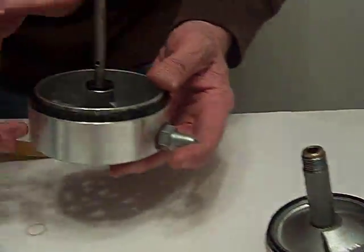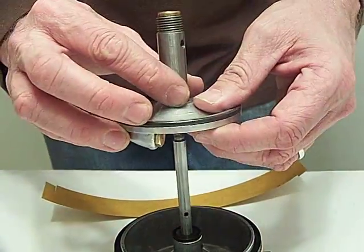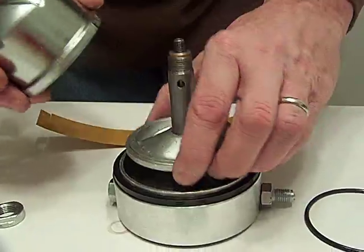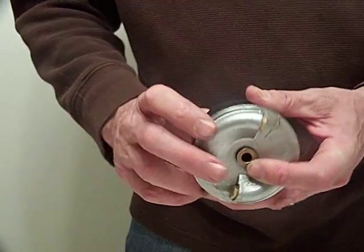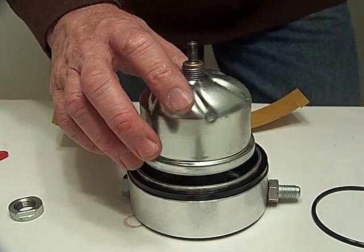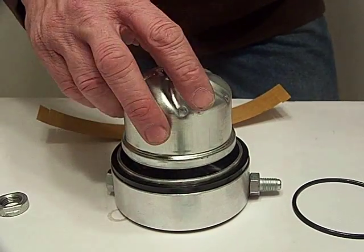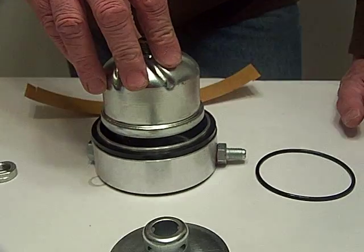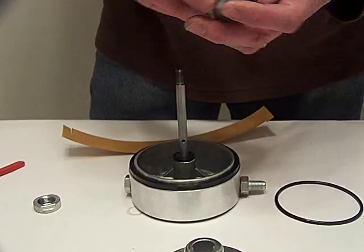You're running at 75 to 85 PSI — it's going to move the plunger back. The oil comes in here up the shaft. You see the two holes in the shaft? This sits on it. The oil comes out these two holes, fills up the rotor, and with the nozzles 180 degrees opposite of each other, you get the spinning action. At 40 PSI, we're talking basically 4,500 RPMs. 60 PSI, close to 6,200. 80 PSI, we're talking 7,500 RPMs. That is the force that will separate all the contaminants from the oil.